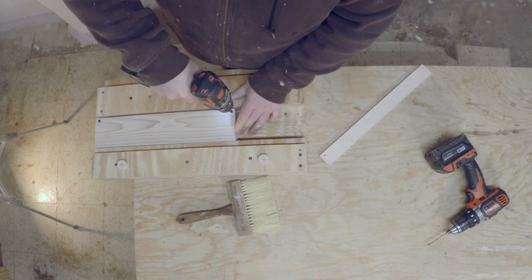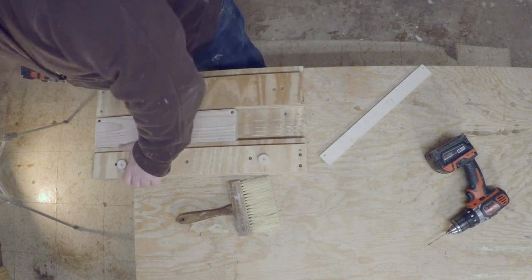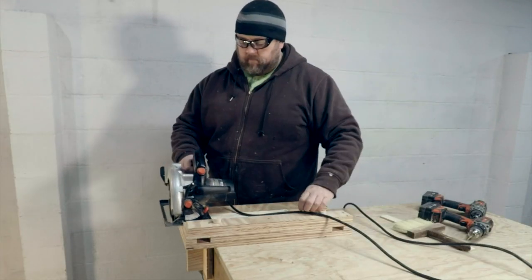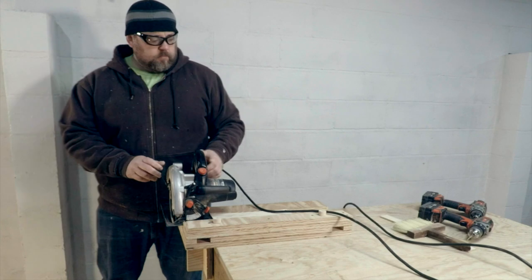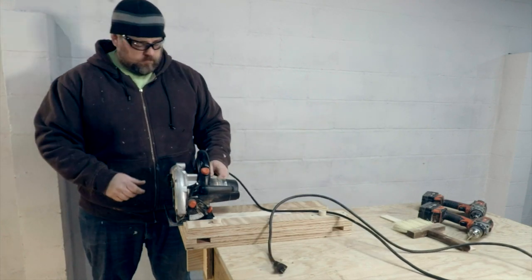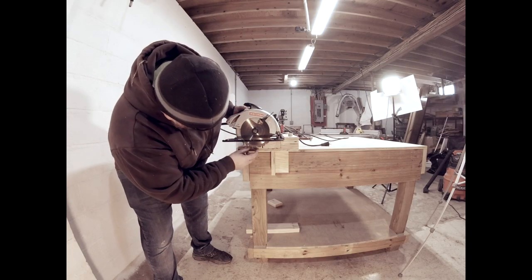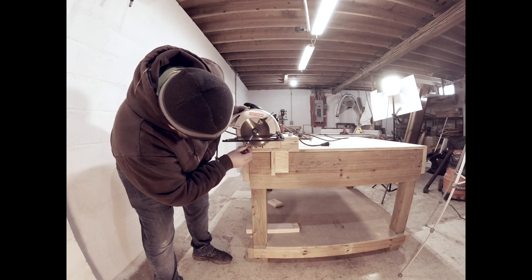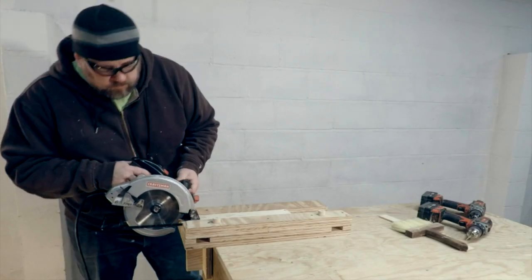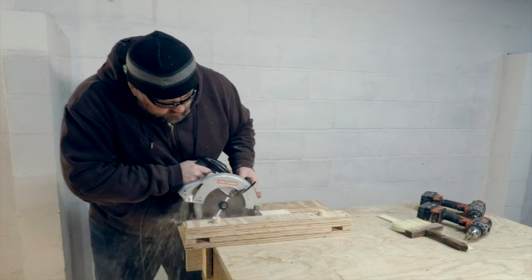The whole idea of this little guide is just to make sure that the screws are hitting in the plywood at the same place every time so the holes don't get stripped out and I can use this jig for a long time. It's super important to make sure that your 2x4 is right up against the rip fence of the jig so that the cuts will turn out perfectly. And with that in mind it's time for the star of our show, the circular saw. I have my saw unplugged there so I'm being as safe as I possibly can, and I'm going to adjust the blade so it's just hitting below that 2x4 and barely nicking the plywood below that. You don't want to put that into the plywood too far.